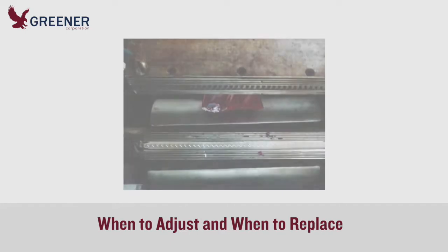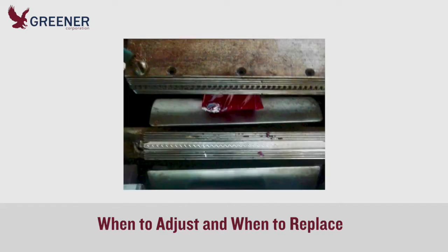If you follow standard procedures and a knife still won't cut without excessive pressure or banging, stop making adjustments — the best solution is to replace the knife and anvil. If you can't adjust a new knife to cut without banging, don't continue. There are likely other underlying conditions that should be corrected, such as worn springs or worn bearings.